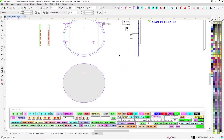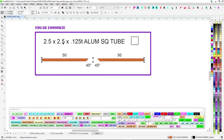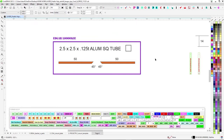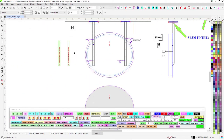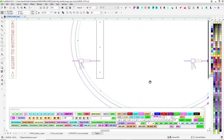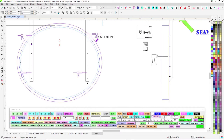At that point, get the legs ready. We're looking at two and a half by two and a half. I know the work order says two by and the permit drawing says inch and a half — as usual, all kinds of different sizes everywhere — but Alma looked at it and she wants two and a half by two and a half. We probably have a stick out back; if not, bring one in. It's 50 inches on the long 45. You can choose to either cap them or drill them before you cap them. Take the jig, bonk it to the bottom of each stick — the sticks will be the same length — clamp it, and do these four holes. Those four holes will match up to the backer, giving you instantaneous registration with the legs.